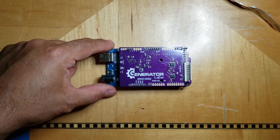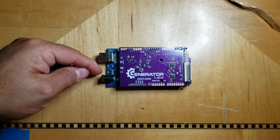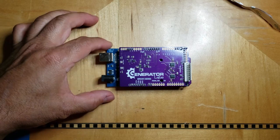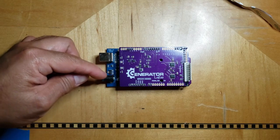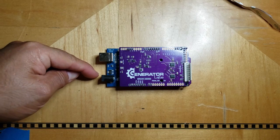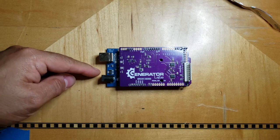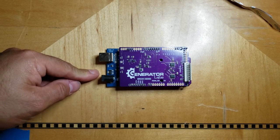So this regulator has losses in it, and it has circuitry in there. And you can't expect to feed in 5 volts and get out regulated 5 volts. There is some overhead that it uses. It consumes some of that power. So if you feed it 8 volts, it will give you a rock solid 5 volt output. If you feed it 5 volts, the results are not guaranteed.